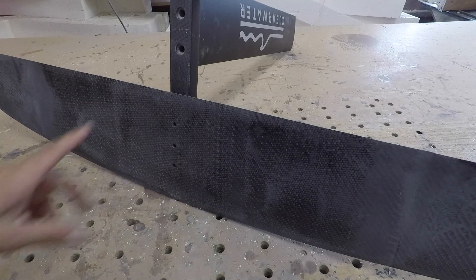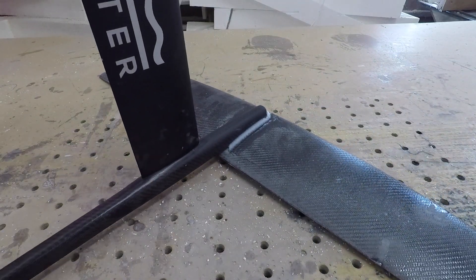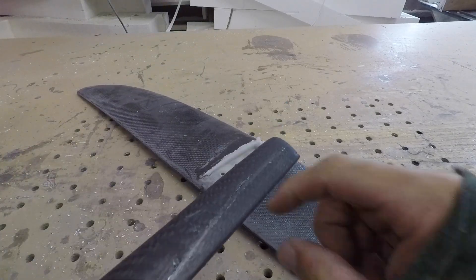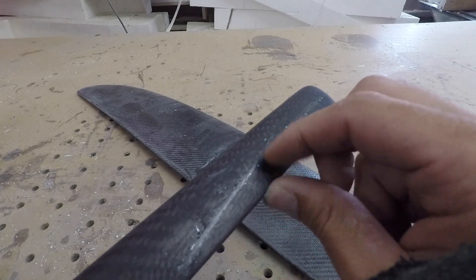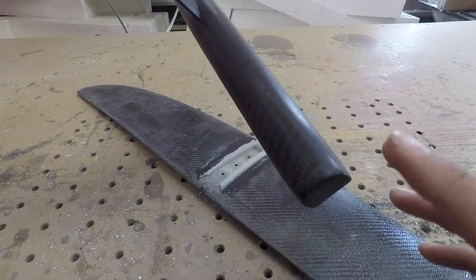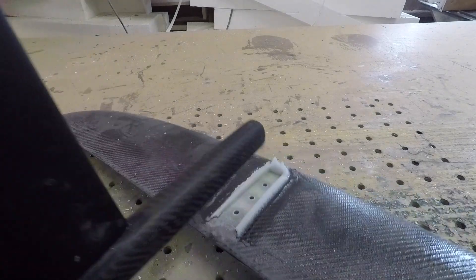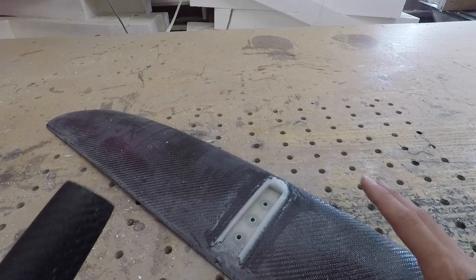This has pretty much cured, so I'm going to pop the fuselage out of the wing. I took the screws out — the first half of the tunnel comes out pretty easy; it's really just the second half that gets a little tough. There'll be some flashing material on the fuselage, and before we do the second half of the tunnel I'm going to clean that up and re-wax it. You can see we now have a perfect molded first part of the tunnel. I'm going to sand down the really sharp edges and get this ready for the second half.